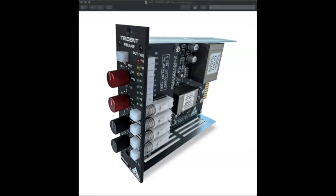And when we actually redid the Trident A-Range, we got a Jensen JT13K, put it in, and Joe Ciccarelli was going, dude, this doesn't even sound anything like it. And we were pulling our hair. The circuit's right. It's the same transformer. We come to find out that Dean Jensen redid the JT13K because he was pissed at Ed Reichenbach for something. So he was trying to get rid of Ed's designs.